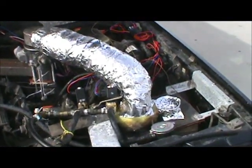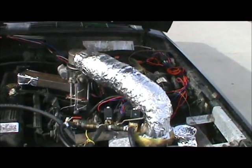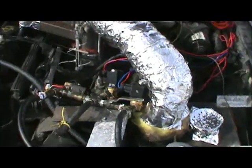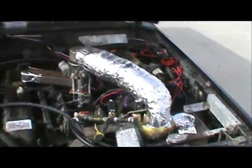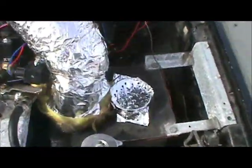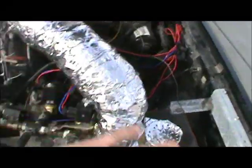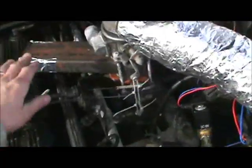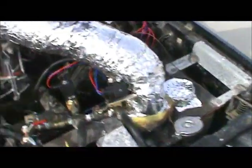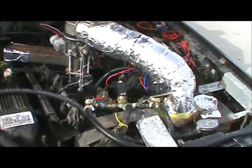When I had it wrapped in an anti-corrosive black, like electrical type tape. So you got to be careful. Do the proper precautions and set things up properly so that doesn't happen. I figured that would probably happen, so I had a fire extinguisher by my side, and I was able to put it out pretty fast. So no flame entered inside my vaporizer container, because I have that flashback arrestor right here at the vaporizer, so that was perfectly fine. It was just right here, and because there was gas on the hose, that caught on fire a little bit. So you got to be safe, guys. Be careful. Have all the right back flash arrestors and stuff like that.